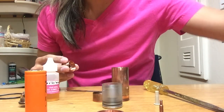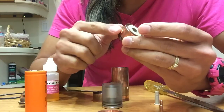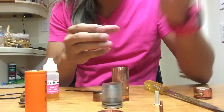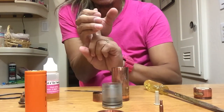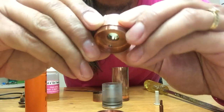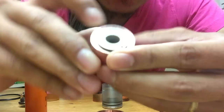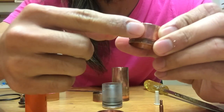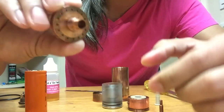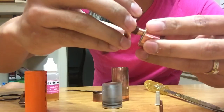Also, this is one of a kind switch. As you can see, it is kind of angled or elbowed, like a C shape. And the way it makes contact to the pin is like that. So the whole thing, I'll show you if you can see it. Where the hell are you? There, see that? So you have to press it in the middle. You can't press it on the side, on both ends. You have to press it exactly in the middle. That's how it makes contact with the copper positive. Okay, so let's put it back together.